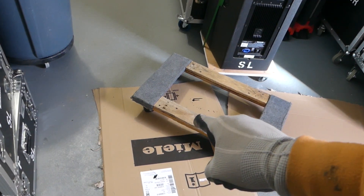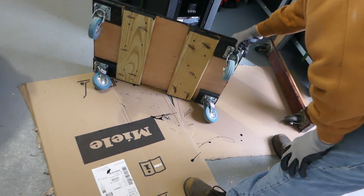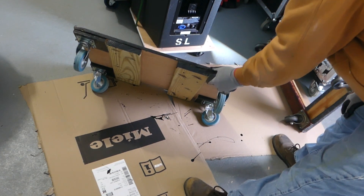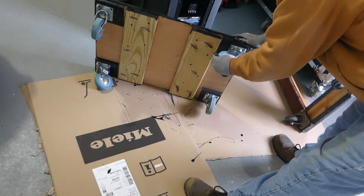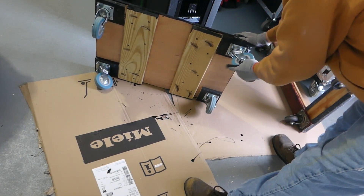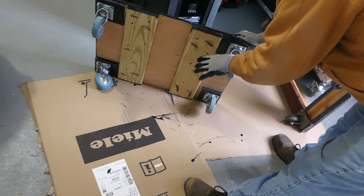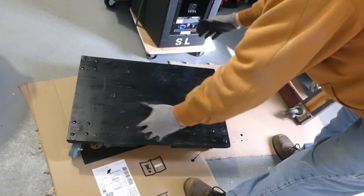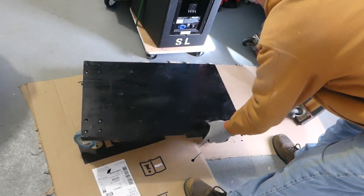I've replaced the old failed caster board with this other one. I generally make my own because in my opinion it's too expensive to get other caster boards. Besides, a lot of these things get rained on, they get abused, they've rolled out of the back of the van — there's always something going on. So I always keep spare casters around. These are four-inch rubberized tires — very quiet moving across asphalt, and the equipment on the caster board doesn't vibrate. There's a little more drag to push across a rough surface, but it's well worth it. I make them the width they need to be, because cases come in a lot of different sizes and not one caster board can work with all of them.